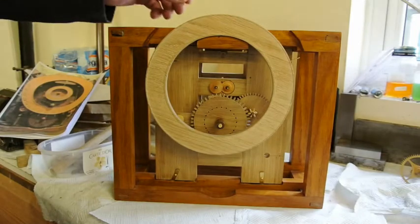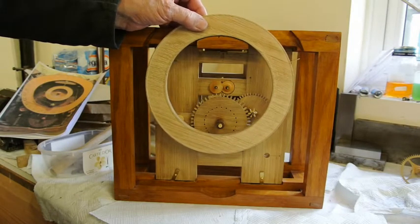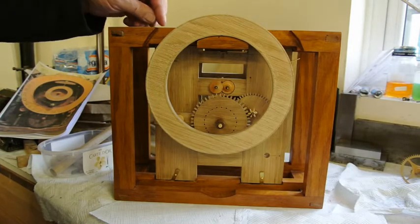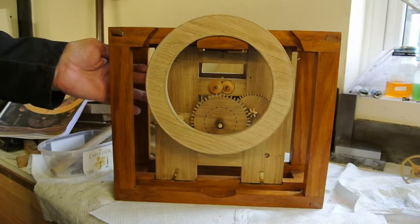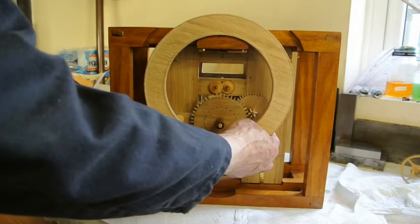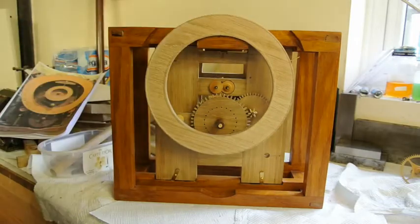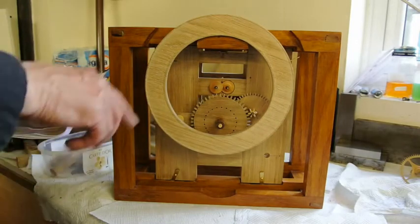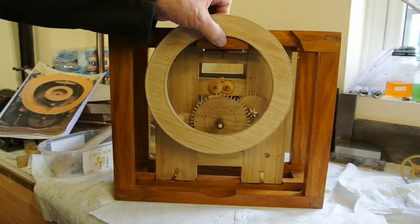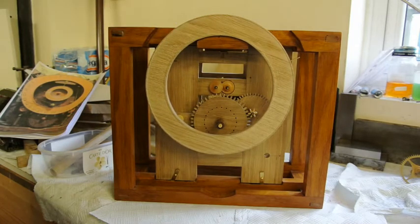As the pin gets to those little bits sticking out, there's like a little railway track in here. It has little studs that go back into the frame here, so this sits on two studs which revolve. At the top there's just a guide to stop it falling over — like a little brass elbow — so it's not held at all at the top other than just a guide. It's very much trickier doing this without having a clock to measure from, and any mistake you make shows up somewhere.